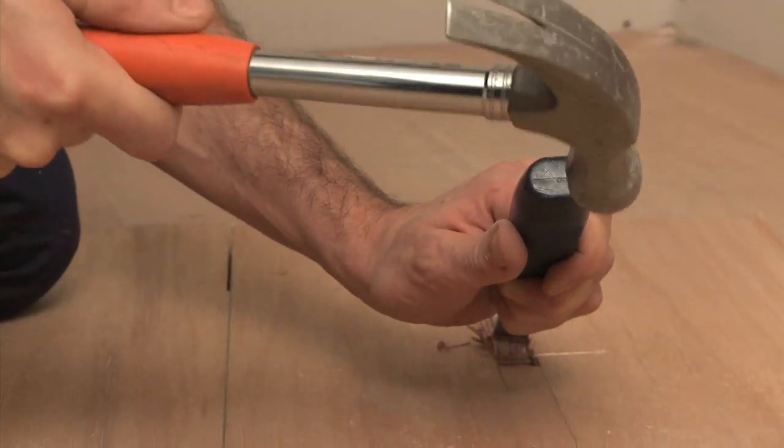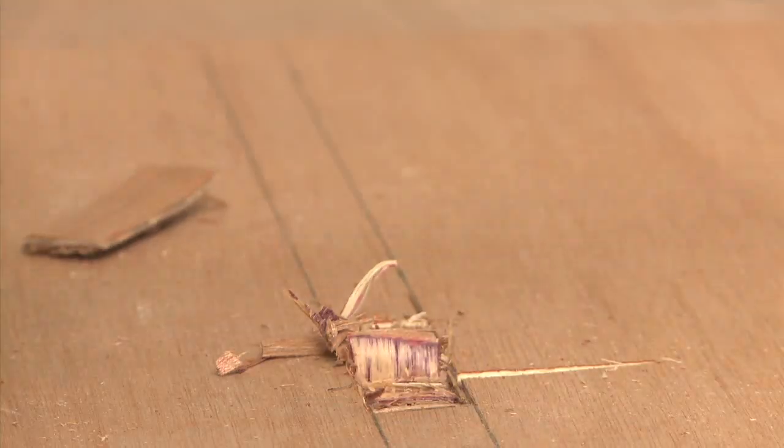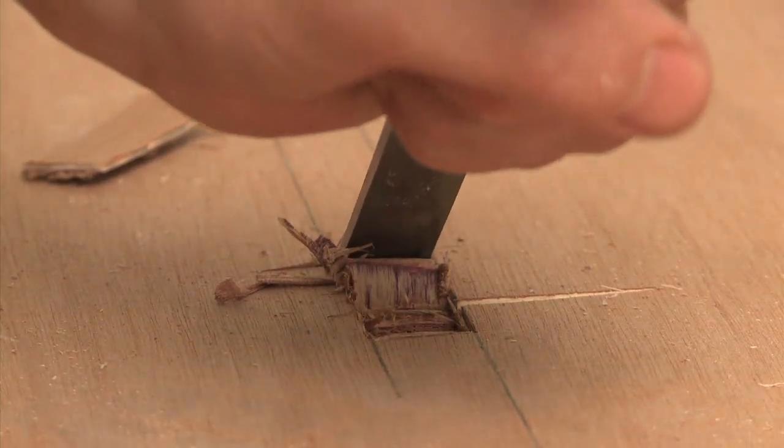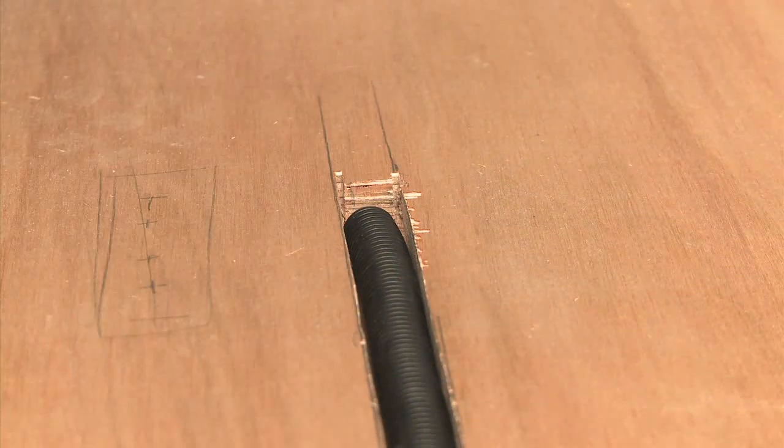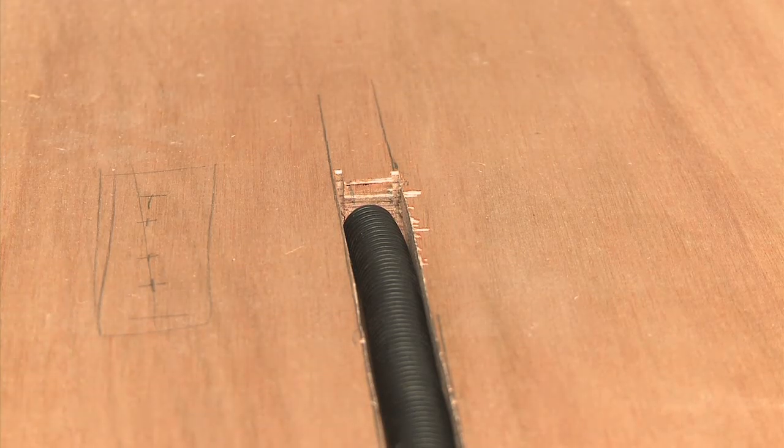If it is your intention to have underfloor heating in your bathroom, at this point you may wish to create a channel for the conduit and heating element at the most suitable position for your wall-mounted thermostat.